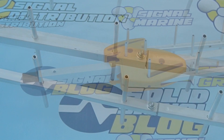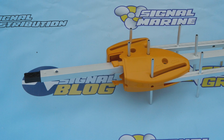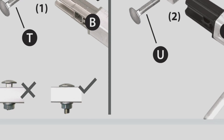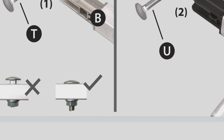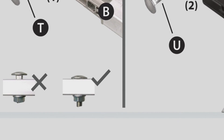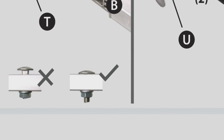Don't forget that on the other side of the antenna assembly you're also going to attach that really small extension pole that you were probably looking at and not knowing what it did. There's a little indication at the bottom of step one showing that you want to take these bolts and have them dig all the way in flush into the antenna pieces. This is going to feel weird because it's actually biting into the antenna aluminum itself, but trust me, that's how it's done.